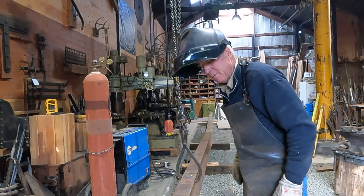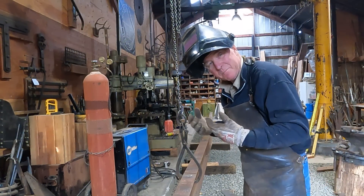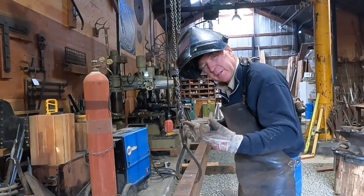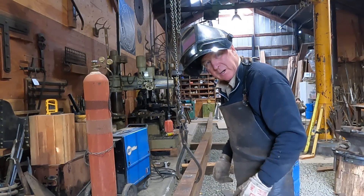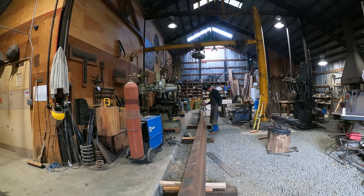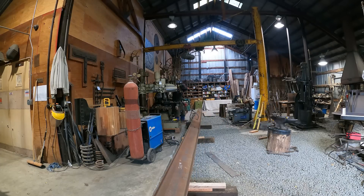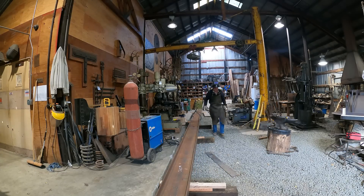So now I've got a 41-foot beam with a kink right in the middle, and it's not fully welded. I think I've got to be a little careful turning it over so I don't tear those welds loose — there's maybe six inches of bead on the tension side. Probably enough. But the beads on the two and a half inch — we'll find out in a few minutes. I'm just going to be a little gentle.